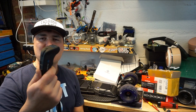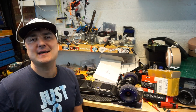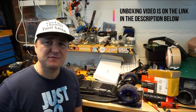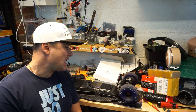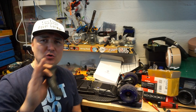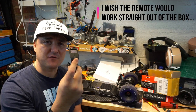This remote is not going to throw you off the board, but when we talk about remotes it's also got to do with the ESC you're using. I am using dual Maytec 6.8 — these are ESCs which are replicas based on the original VESC 6.0. Together with this remote they're working really nicely. So far so good — really smooth, no disconnects, nice braking, a really smooth throttle curve and braking curve.